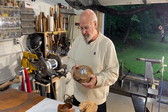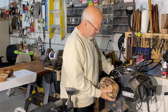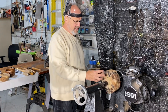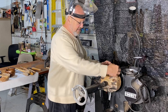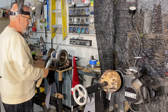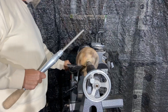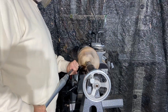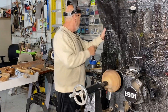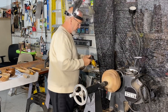So it's a small enough piece — I feel safe enough that it'll work. Let's mount this up and see what we can get out of her. I'm going to put a small tenon on here just because it'll give me as much room as possible to cut some of this outside off. This is a 5/8 bowl gouge — this is a Carter and Sons.